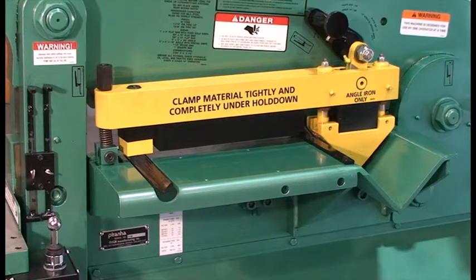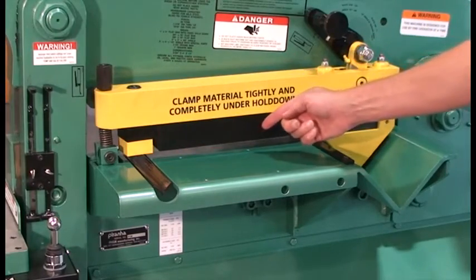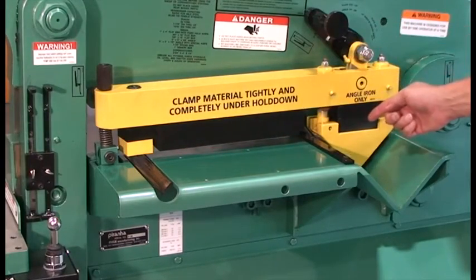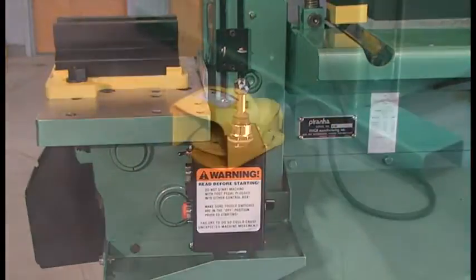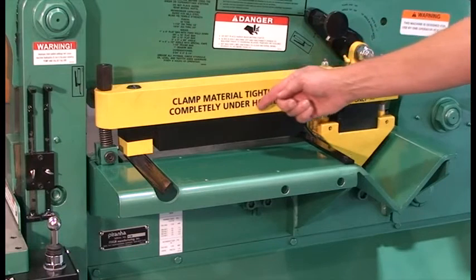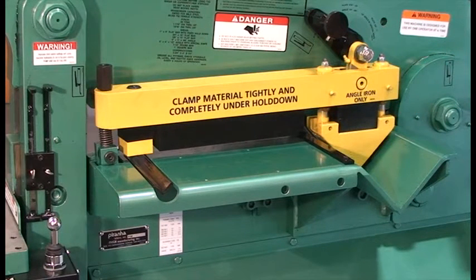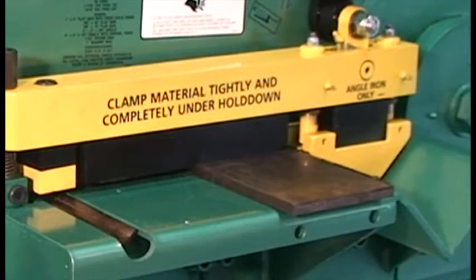This is the shearing section of the Piranha and contains workstations to shear round or square bar, flat bar, and angle iron. It can be operated with either the joystick or foot control. A feature unique to Piranha Ironworkers is the automatic urethane hold-down. This hold-down is used to automatically clamp the material prior to shearing. The hold-down securely clamps the material to the shear table, thus holding it in place for safety and precision shearing.